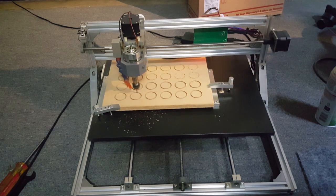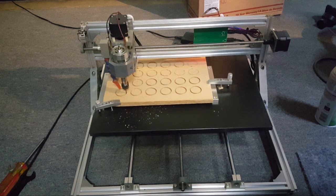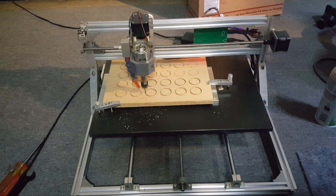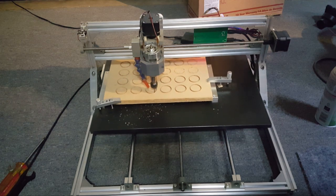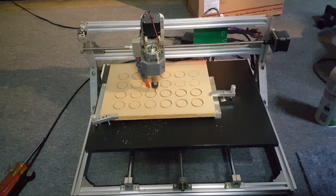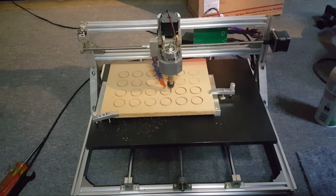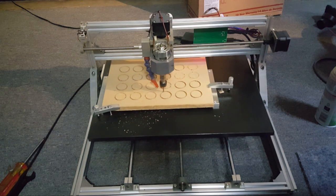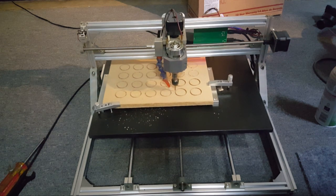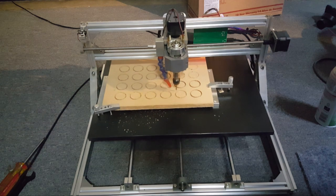I used to just completely drill out the middle, creating a lot of swarf. I decided to just do a facing job on the outside of it. This is a 5C collet rack I'm making. It's going to take about two hours — it used to take all day, like six hours. It doesn't want to do one hole at a time; you can see it's skipping. It's taking 10-thousandths cuts at a time, a lot less swarf, therefore a lot less vacuuming. This was well worth the time and money. This bit is definitely the best one I've had for MDF — it's single flute, looks like a drill bit with one flute removed.